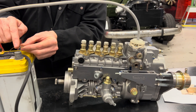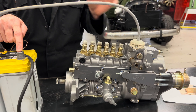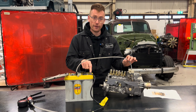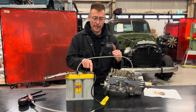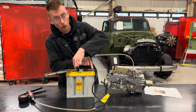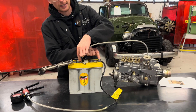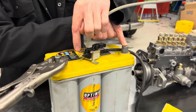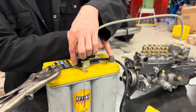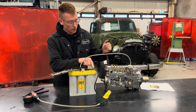As I put this back on, it comes back forward. When that goes back forwards again, it had to evacuate that vacuum out of here — because the vacuum would still be there and the lever couldn't come forward. That is what the vent port is for. When we make that live, the vacuum is dispersed — pressure comes into this point and it defeats the vacuum.